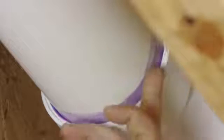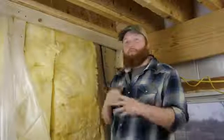Also, you want to make sure you properly secure them so that when you're walking around they're not vibrating and they don't break loose and cause a leak. Make sure you get the adequate amount of glue, and you can also see the cleaner around here. You want to make sure that you get a very good connection when you put the two pipes together. You want to make sure you support every connection or union that you put in there.